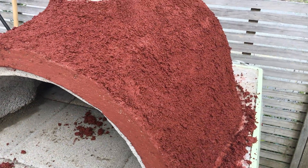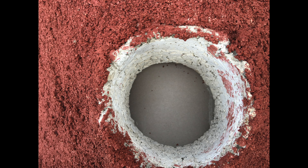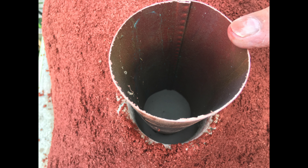To do the chimney, we blocked up the big gap underneath the chimney hole with some blocks of wood. Here we have our piece of copper pipe that we've just cut, sat on top of a piece of cardboard which was blocking the hole at the bottom. Because the chimney pipe was smaller than the hole, we just filled this gap with a fine cement vermiculite mix.